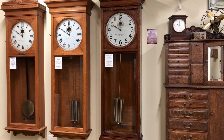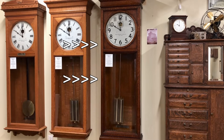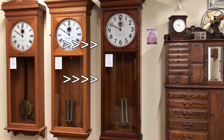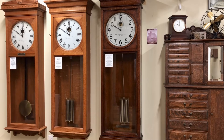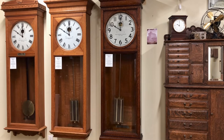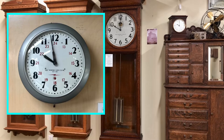To demonstrate how this ingenious system works, I removed the movement from the indicated master clock on the right. It was used by the Canadian Pacific Railroad and dates to about 1918. Second speed self-winding master clocks with mercurial pendulums are very accurate. When equipped with a synchronizer, accuracy can be assured by checking with naval observatory time every day at noon. The subsidiary movement is from the clock in the inset photo. It was made for the military and is from about 1950.